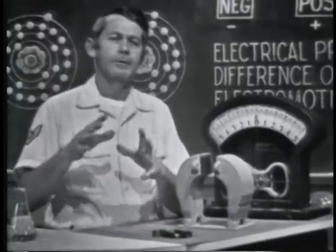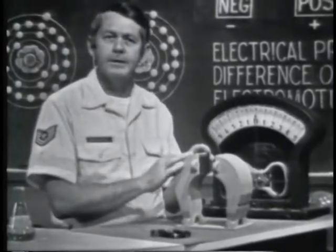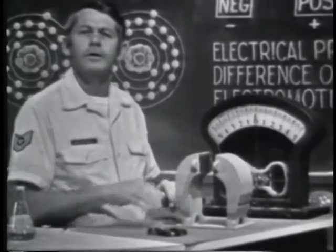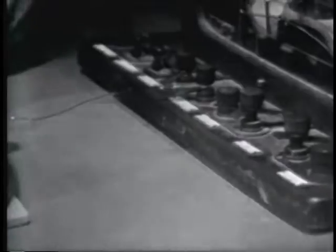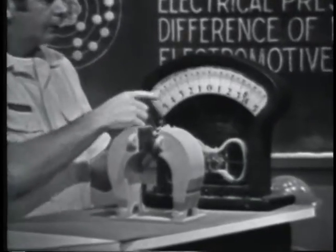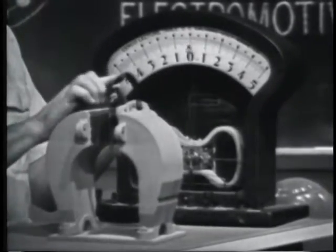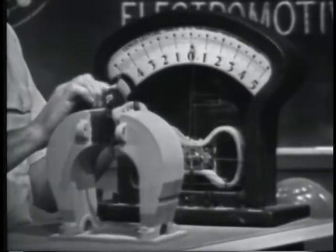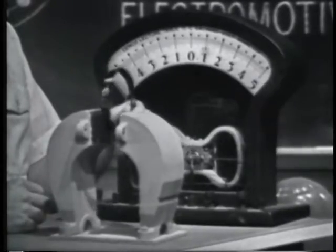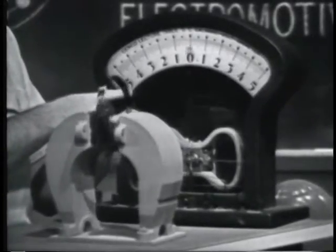Let's demonstrate this method. We need a magnetic field, a conductor, and motion between the two. Here's a magnet — it'll give us the magnetic field. This coil of insulated wire is a conductor. To check for a voltage, I'll connect the conductor across the meter. When I start moving the conductor, notice that the meter indicates a voltage. It doesn't make any difference how the motion is attained — the magnetic field or the conductor could be moved. The important thing is there must be relative motion between the two. Notice that the meter needle swings back and forth as the conductor is moved. This is because the field will force electrons to one end of the conductor and then to the other. The result is an alternating, or AC, voltage.